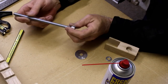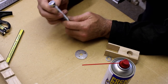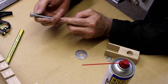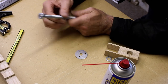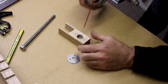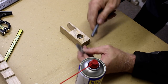The threaded bar is cut to length now. I've installed the nut — it's a nylon nut so it kind of locks itself on, but to make sure I've burred over the end using a hammer and centre punch to distort the thread so the nut can't pull back off. I'm going to start assembling, putting in a small washer first and then a little bit of lubricant so the nut has something to slide up against.